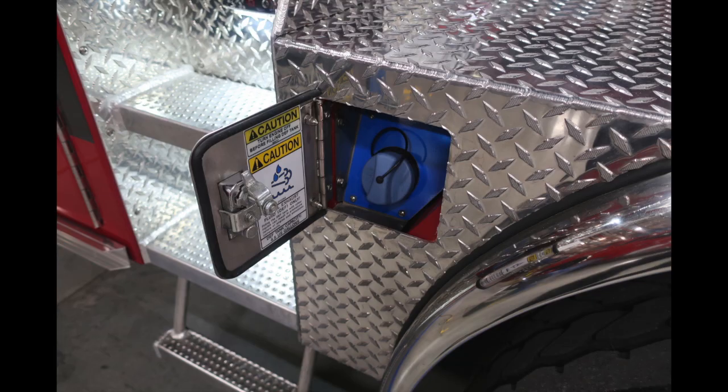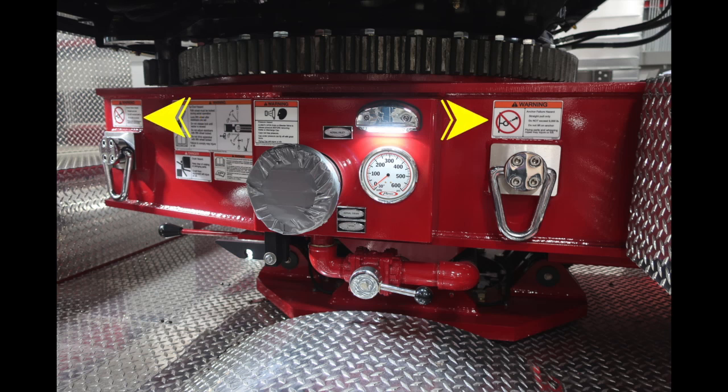Near the steps, you'll find the DEF fill location, 4.5 US gallons. It's a blue cap. Located between the tractor and the tiller, you'll find the connection location. Also housing information here regarding a warning label in using those side-facing attachment points. There's also warning labels here that you should seek the owner's manual prior to use, in addition with danger and additional warning labels regarding the possibility of pinch and pressurized caps, and the associated hazards with caps that are pressurized while removing.